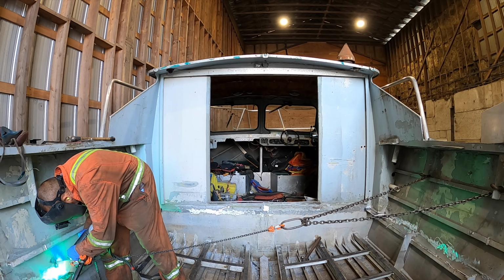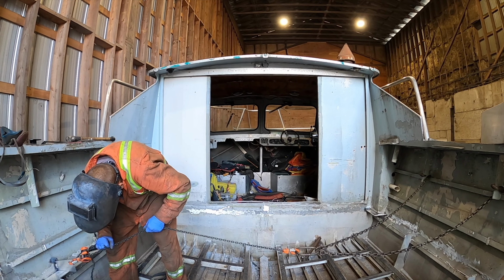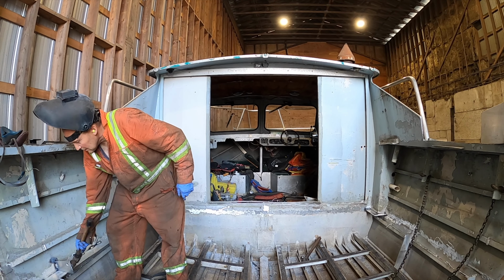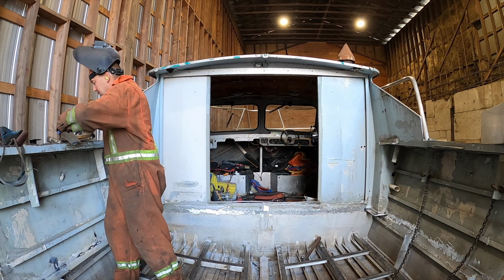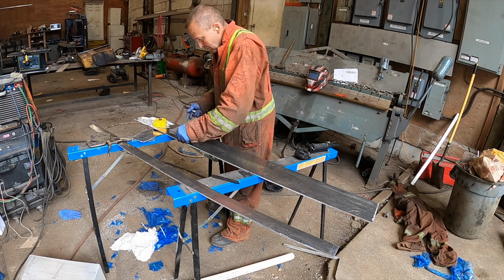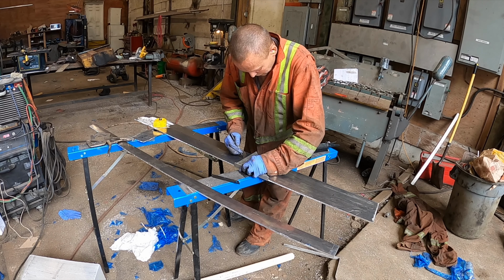So anyway, I pulled all the sides in, got it all straightened out, and then welded it all up. So it's ready to weld, and then I cut the deck on to make it fit. Okay, so we need a center plate for the deck to bolt to. I just cut a chunk of 1/4 inch plate into 6 inches, and then cut another piece into 2 inches.